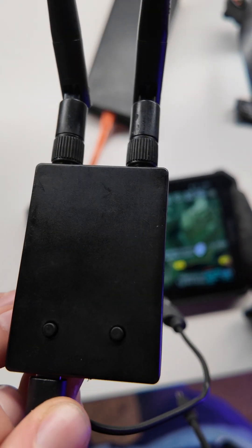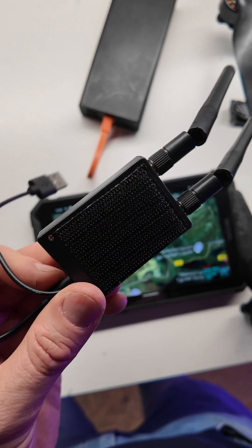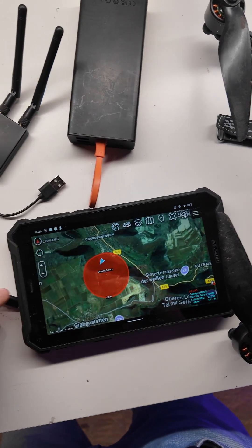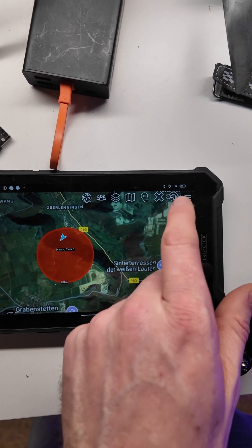It's not a standard connector, so what I did is open it and look for a five volt and a ground pin to solder onto — and I found it. Now you have your device and you need an external power source. You plug it in here, and you also need the USB tool.